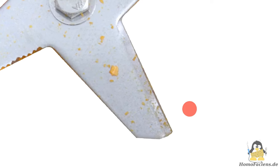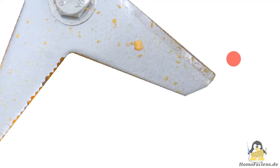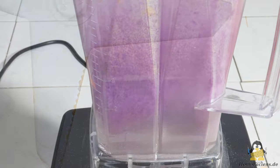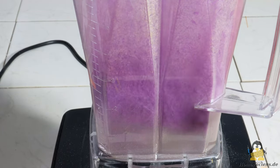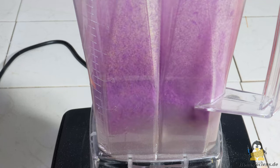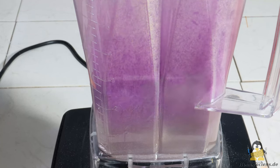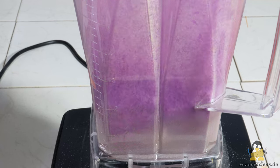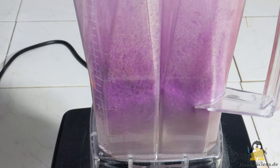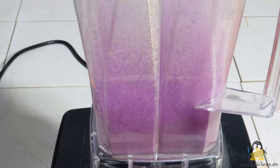There is even a minimum particle size or minimum mass for the grains beyond which no further material can be removed by the plate. Furthermore, grinding with the blender is a statistical process because the angle and speed at which the particles and the plate collide is ruled by chance. A particle with a given mass and diameter does not always have the same chip size cut off. Let's leave it at this fairly simple description of the processes, otherwise the video will turn into an evening-length epic.